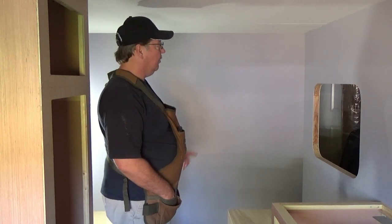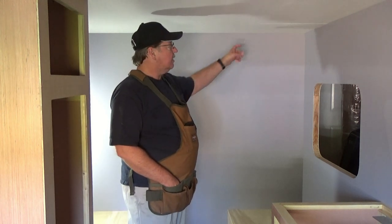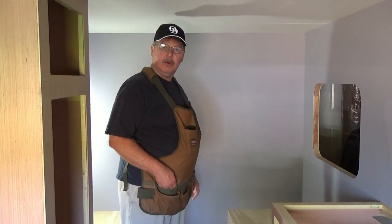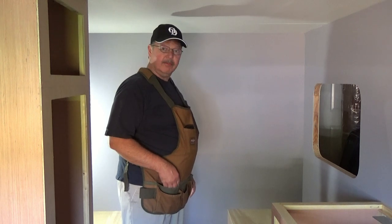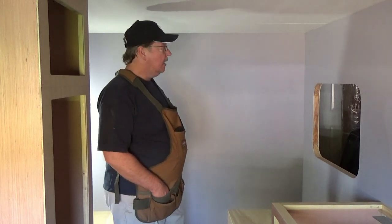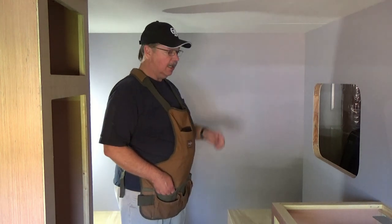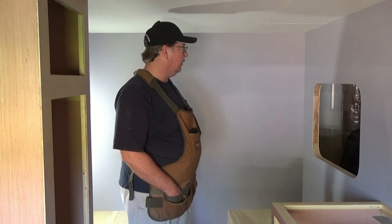So with that, what we're going to do first is we're going to go ahead and cut our sticks, and I think we're going to use 1¾ inches. And the reason for that is when we go to router out our holes for the openings, our router will clear all the way around. So that's a good number, and it's easy to remember.